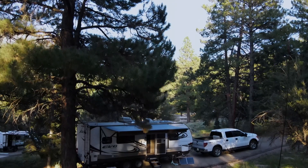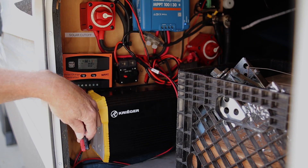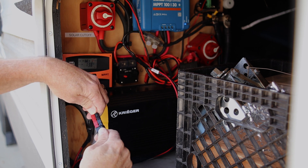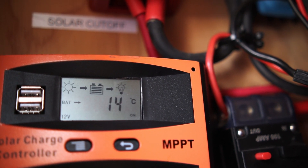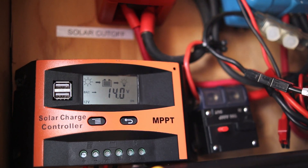There are a number of times when we go camping where we're parked in the shade — there happens to be a tree at the campground or maybe it's going to be a cloudy day. You can still charge your batteries when it's cloudy. So I'll take this solar panel and plug it into the adapter on my camper. I have Anderson power pole connectors with a breaker that ties right into my electrical system, and an MPPT controller that I use specifically for this unit attached into the battery circuit. So it's easy to plug the solar panel in and move it around while we're camping.